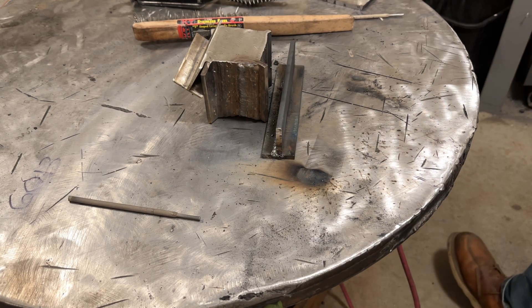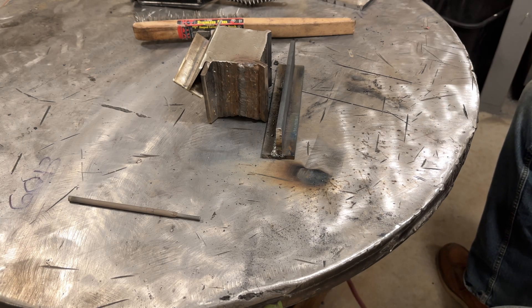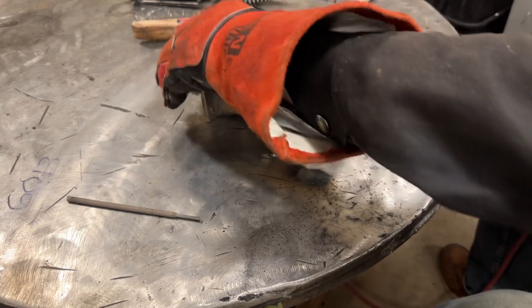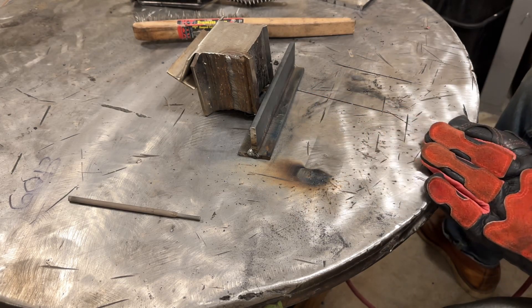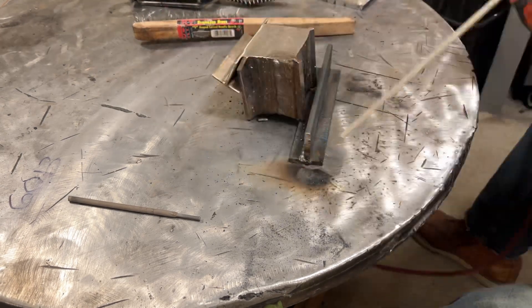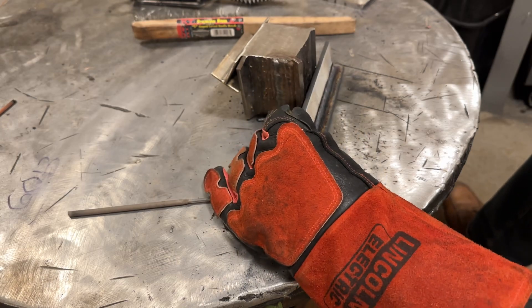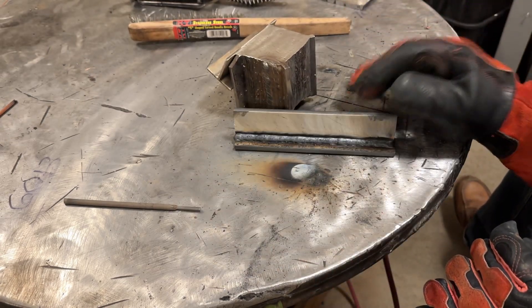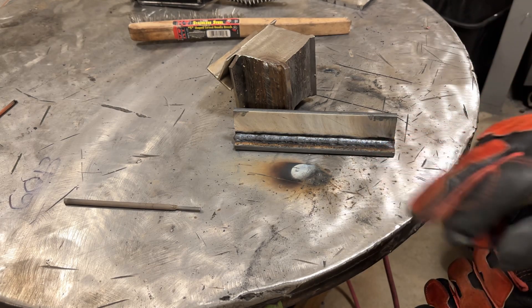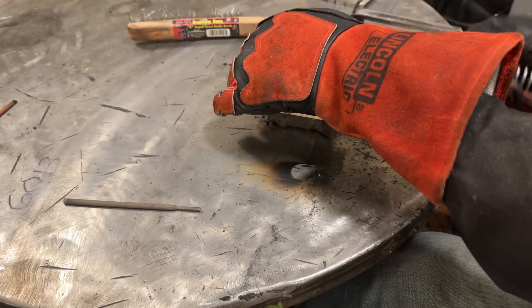In the shootout video, I honestly didn't really feel like the bead was run cold — it's just that the penetration was a little bit odd. So being at 130 amps, it should have good penetration. There's no question that was run hot. Let me do this second pass and then we'll cut it and etch it up. That ran about perfect at 120 amps — real smooth. You can tell just by looking at the flux how completely even everything looks: the dust, the black line, the coating. Perfect. I don't think it really gets any better than that.